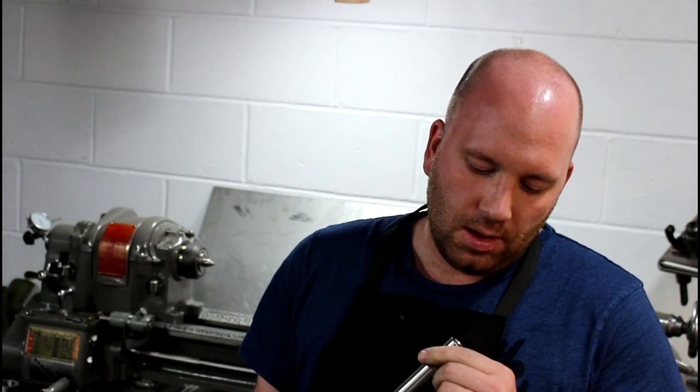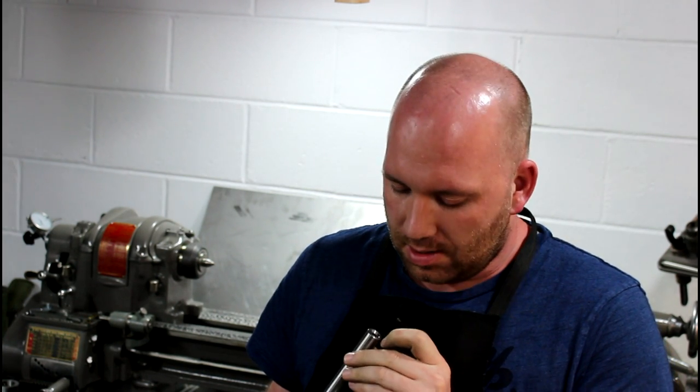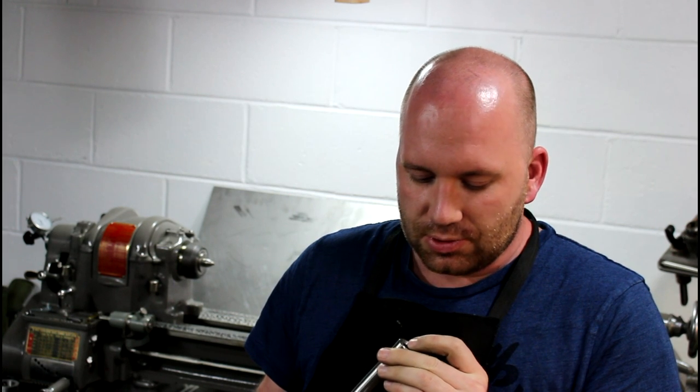We'll see. I also wanted to mention, when you saw the crown, when I was doing the crown, it looked like the bore had run out, and that was actually because I hadn't cut in deep enough to get rid of that chamfer that they put right at the end of the land. So after I got done recording, I made one more final cut in there to clean that up. I had a half moon because they cut it off to begin with, and once I cleaned it up it was running true.